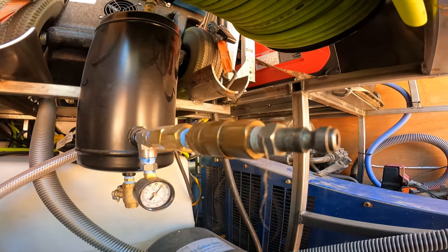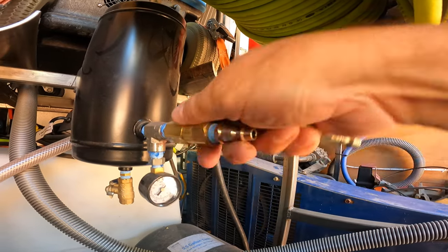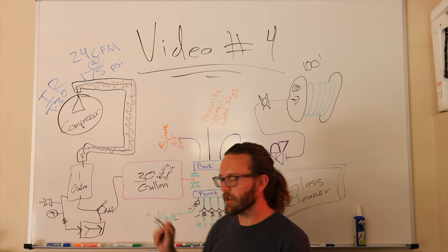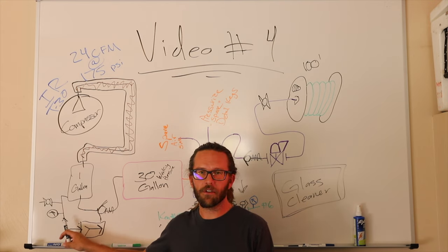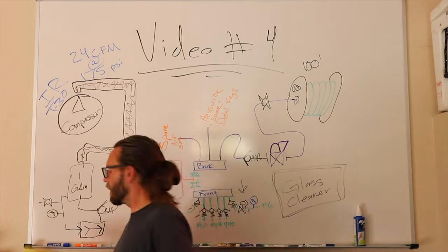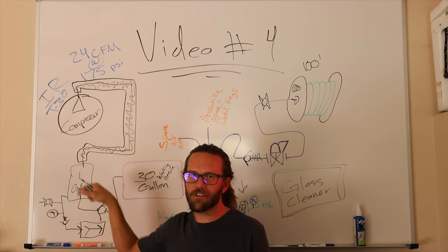The reason for the quick disconnect number one is because there's two different fittings. Okay, I used to go to different shops where they had different air fittings, so that was easier for me just to use the adapter. Okay, pretty neat. That goes through a check valve. The reason for this check valve is because it's a male fitting. There's no guts in there to hold the pressure back. I drew that backwards, by the way. So then when it goes in, it pressurizes in and it locks the pressure inside your system.